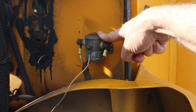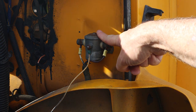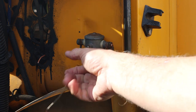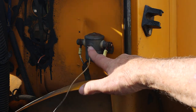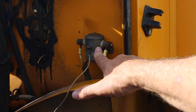I doubt very much in normal operation you would want this relay to be energized the whole time — it would heat up, get hot, and more than likely fail over time. So by grounding this terminal right here, that would pretty much prevent this relay from triggering to stop the bus from starting.